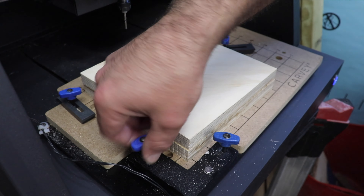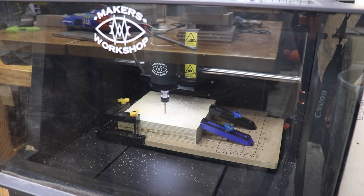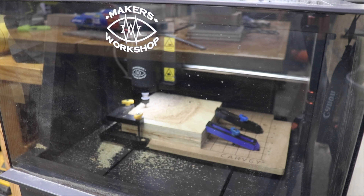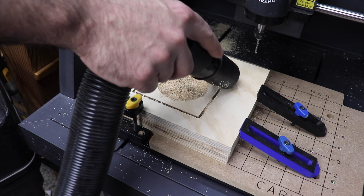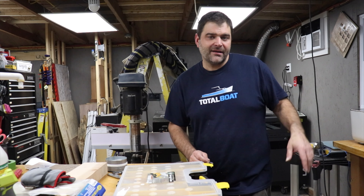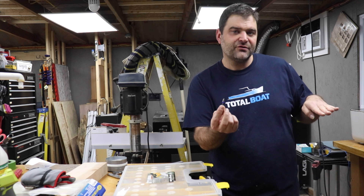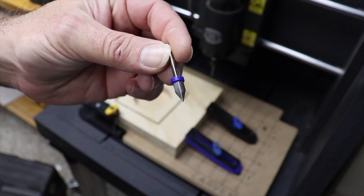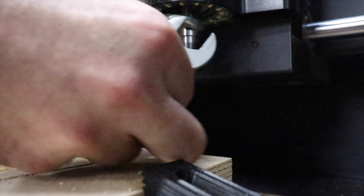The plywood block was a natural starting point. It was the block of wood that I was the least excited about — if everything crashed and burned I wouldn't really care. So now we're gonna change the bit and put a v-bit on it to put a slight edge on the piece, a little bit of a taper, so that it will give it a richer look. This is a 60 degree v-bit and I set my machine to run along the exterior and interior to add a bevel to both shapes.